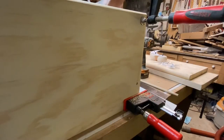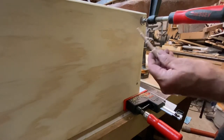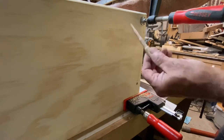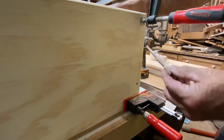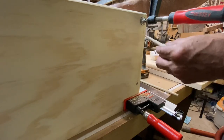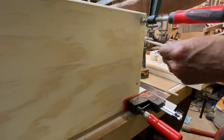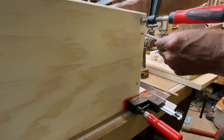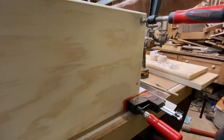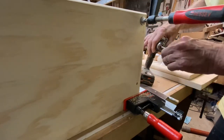The inside here is end grain, and screws do not hold very well in end grain. So in here, I'm going to be putting a Miller dowel. I love these things, they really hold well. If you go picking this bookcase up, even to move it out to plug in something, there's going to be a lot of weight in here. And if you pick up the front, that screw is likely not to hold. So long story short, I don't need to pre-drill here because the Miller dowel will hide it.